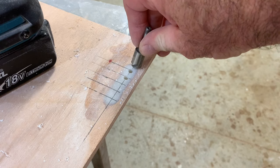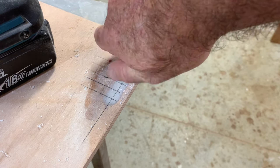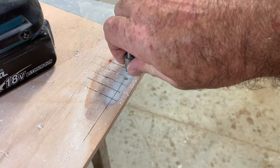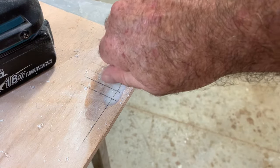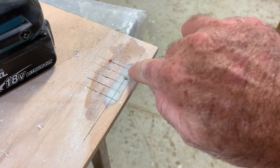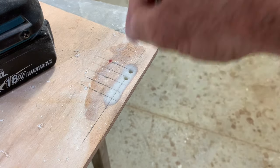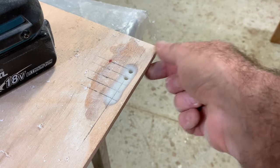And then this epoxy is still soft enough just to give it a quick turn by hand with a countersink bit, just to create a soft edge for the line to go over. So the line doesn't actually run through these holes, other than when you're threading it. But I think it's the right thing to do in terms of making the turn that is not a sharp edge. We'll glass right over this.